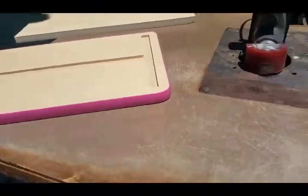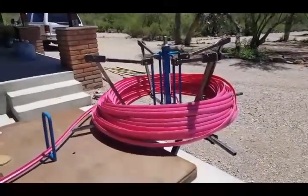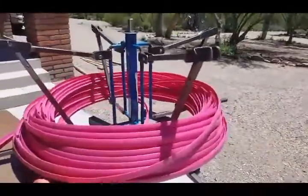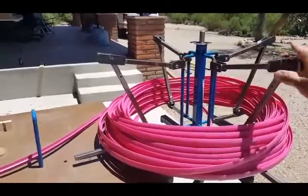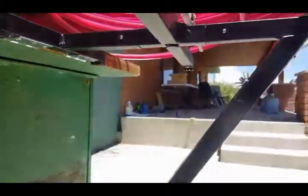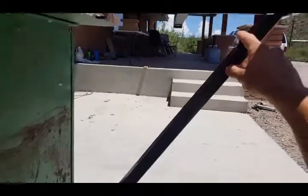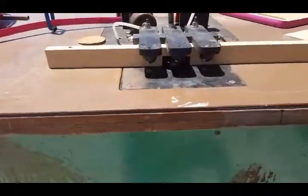This is something you won't see on any other T-molding machine out there. This feeder is a mechanism that I built for this machine. Believe it or not, there are no feeders for T-molding machines — T-molding comes in a box just all loose, so without a feeder it would quickly turn into a huge mess. This whole unit breaks down: this whole plate here flops down to the side, the support leg is held in by wing screws, and the entire top can simply be lifted off, which works great for storage and extra room.